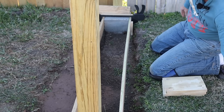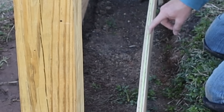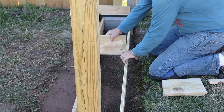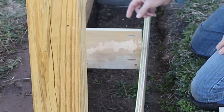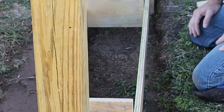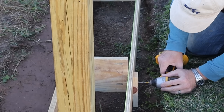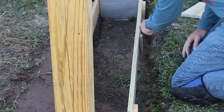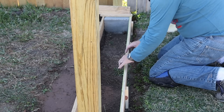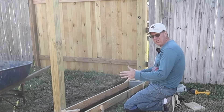I've got those two end sets done, and then these two middle ones I'll guesstimate right in here. My string line is inside — not on the edge. This board's ten inches wide, and I'm going to put it right where the braces are on the other side. It's pushed out and my string line is right against that edge. I'll put a stake here, pre-drill, and sink a screw. You can see the string line is pretty close to sitting on the edge of this board, and I'm okay with that — by the time I get concrete in here and vibrate, it'll push these out a little bit.